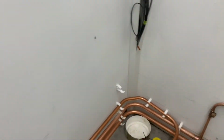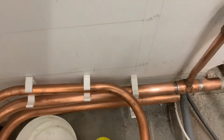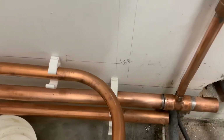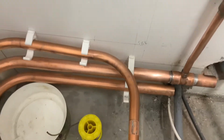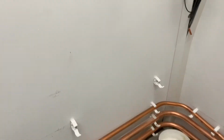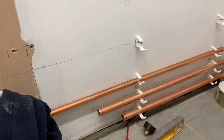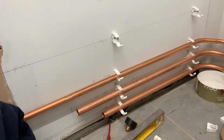So that one's just a bit, I measured it all up, but it's just a bit sharp. I think I want to have 6 inches between cylinder and wall, so it's going to 5-inch marks. I want 5/8, so I want to use this as the flow pipe, should be that top pipe there. Put some 5/8 packers, pack them clips up 5/8, and that will stand that pipe further off and make it good for a pump. And then you get the pump things on. When I get that on, it'll come right.